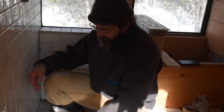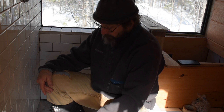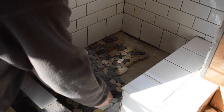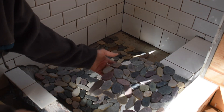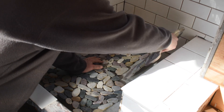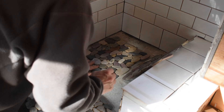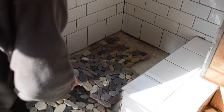I'll put the river rock floor on the mortar pan, let that sit for a day and a half, then come out late tomorrow afternoon and grout everything up. If you've never used these, the rocks are epoxied onto mesh and they have these indentations — those two outcropping rocks fit into that little indentation there, and similarly the other indentation gets filled by the adjacent rocks, so it looks pretty seamless. You just peel off the ones you don't need and figure out how it's going to fit.